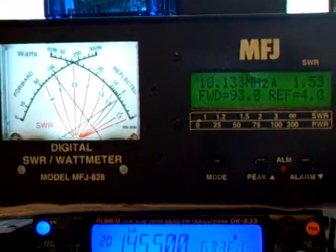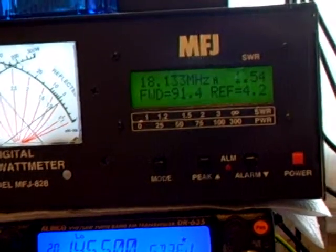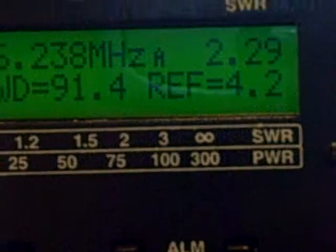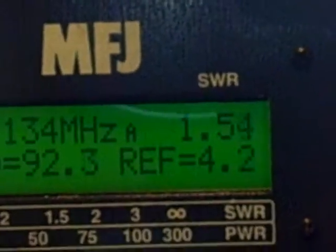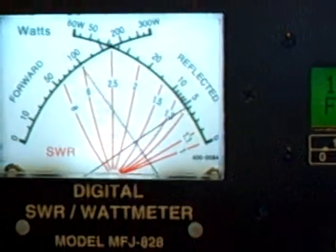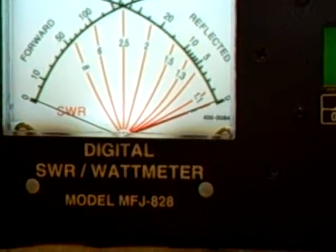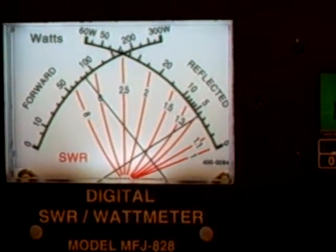So that's going to be average - half of the power. And that's 93 watts, so we've got about 93 watts coming out - 91.4. And the SWR is 1.5, roughly. Not done any tuning, straight from the cobweb. So the cobweb's just tuned up on 17 meters.